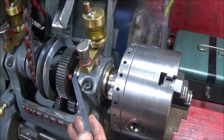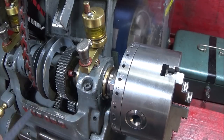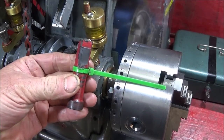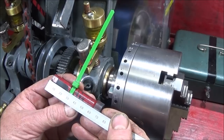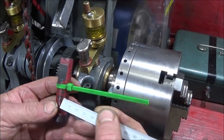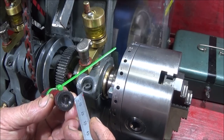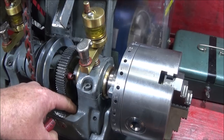I thought of making use of the head of this allen bolt here — this is the allen bolt which you disengage the teeth from the gear for when using the back gear. As long as this is nice and tight, you can actually use it with this tool that I have made. This is made out of a piece of dense PVC, 70 millimeters long, turned down to about 15 millimeters in diameter on the main part. The lower part is about 19 millimeters in diameter. I've put a recess in the underside that drops down onto the allen bolt which actually holds the headstock onto the lathe.